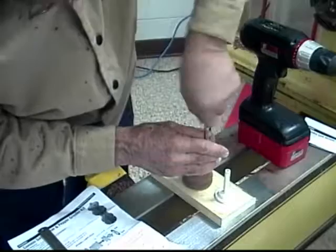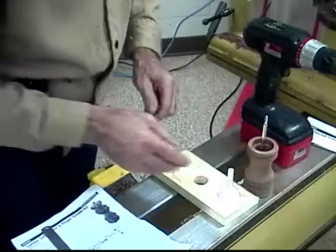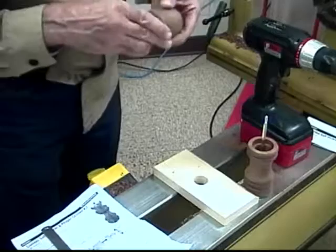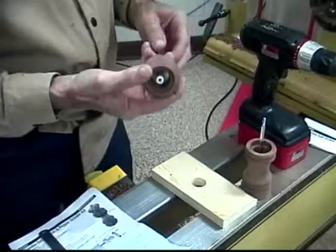Okay, so the bottom should be recessed a little bit, so that your screws are deeper than the edge of your pepper mill and it'll sit flat on the table. And then you do the top. Like I said, that's an inch and a 16th. And that's not quite a snug fit, but it's close. So if you want to pre-sand that inside a little bit, we probably will do a little sanding in there. But just don't hit that bottom hole or make it any bigger.